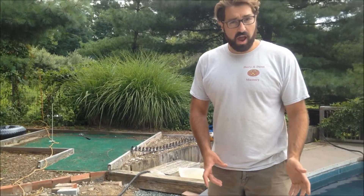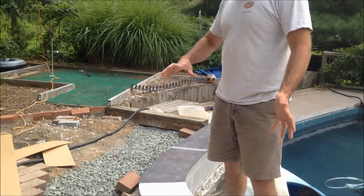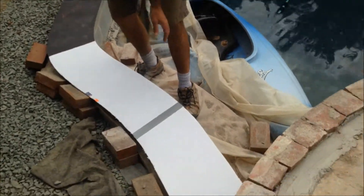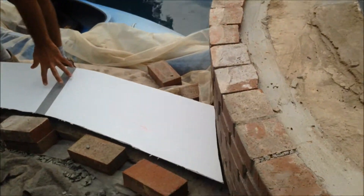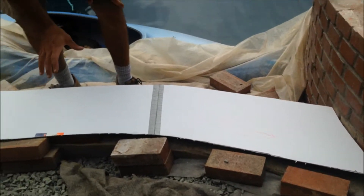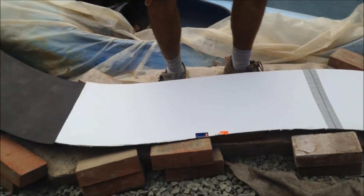As you can see, it is not your average straight or circular pool coping — it has very lots of twists and turns. So what we did here is we used this foam board and we marked out the shapes and cut the shapes first, and we will be transferring those then onto stone so we can get an accurate cut.